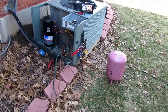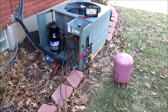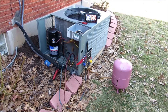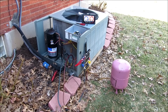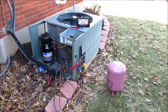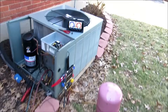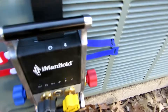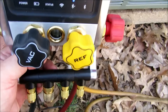When I arrived, right down here at the liquid line port, I did find some oily residue. So hopefully I can charge it up, put some Nylog on it, and hopefully that'll seal it up. If not, when they get back home they've got me scheduled for a spring maintenance anyway — I'll pull the sniffer out if we're low again. Anyway, we are very low on refrigerant.